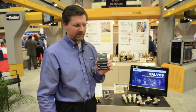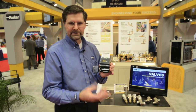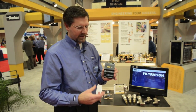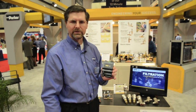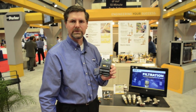This is a positioner that we plan on using when we first release this. Right now it's in qualification. It takes a zero to ten volt or four to twenty milliamp signal — that's the initial release. Eventually we plan on having a standalone controller to go with this. So that's where we're at with the transcritical gas cooler controller.